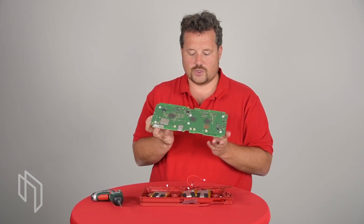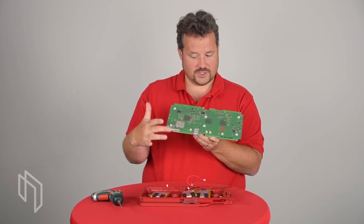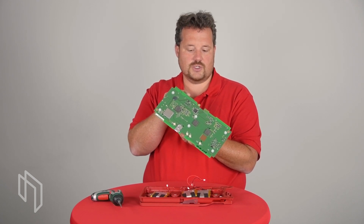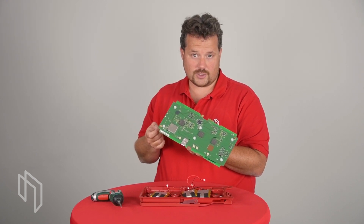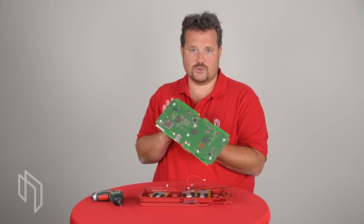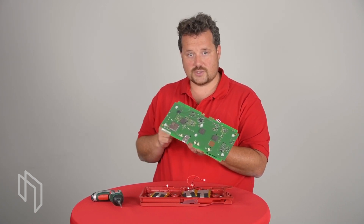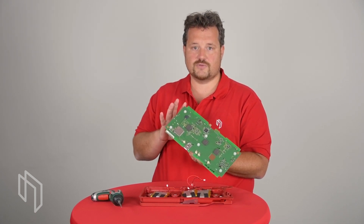To show you the basic components on the board: we have a 4G module with a 4G antenna, a GPS antenna that is just a part of the PCB itself, and a 2.4 gigahertz antenna which is needed for communication with a management box for configuration. It's also used to synchronize boxes — if you have more than one box at a timing location, they talk to each other and synchronize. And it is also used for receiving track pings from active transponders, so yes, this box can receive track pings from active transponders and does both passive and active at the same time.